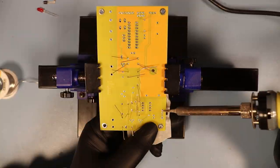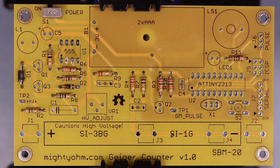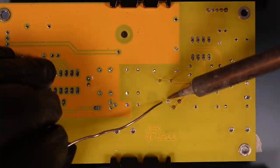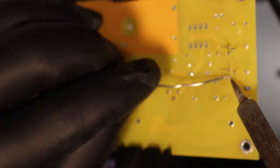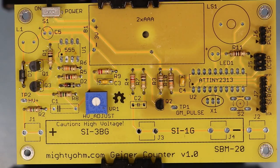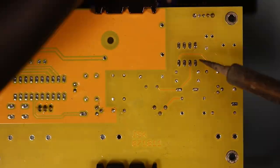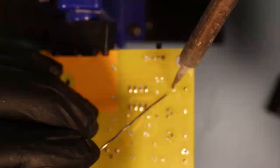Other components, such as the side switch or the variable resistor, are held down with a piece of painter's tape, while others, like the sockets for integrated circuits, can hold themselves down by friction alone. Either way, I always start by tacking down one leg with a blob of solder to hold it to the board. Then I won't need to worry about whether the component sticks, and I can use my free hand to make sure it's mounted flat against the board while reheating the only soldered leg. When I'm satisfied, I solder all the remaining legs.